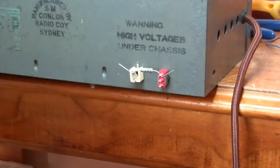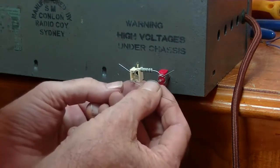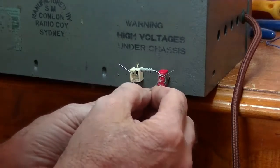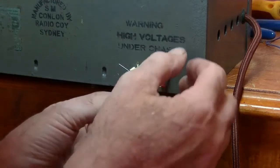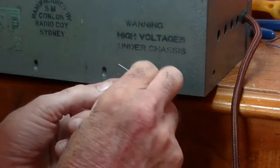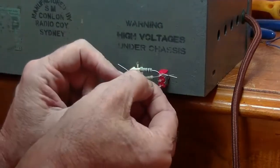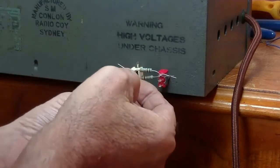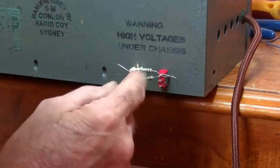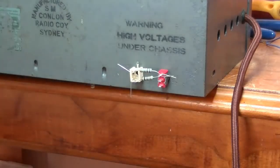And this is why I use resistors rather than little bits of wires. The second resistor from our stereo jack goes again to the same terminal on the switch. Spin that around so we can get it in. Bend it in place. So our stereo signals are coming through a 1-ohm resistor. It'll provide minimal resistance to the signal. Shouldn't degrade it noticeably anyway.